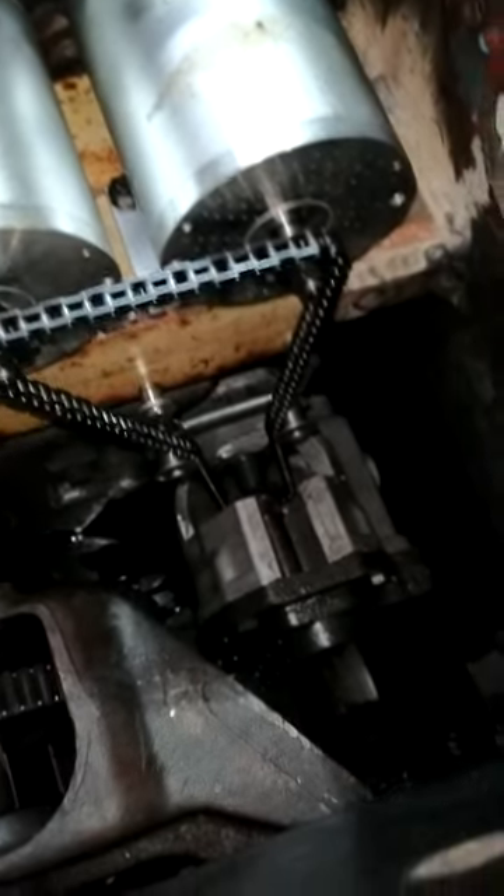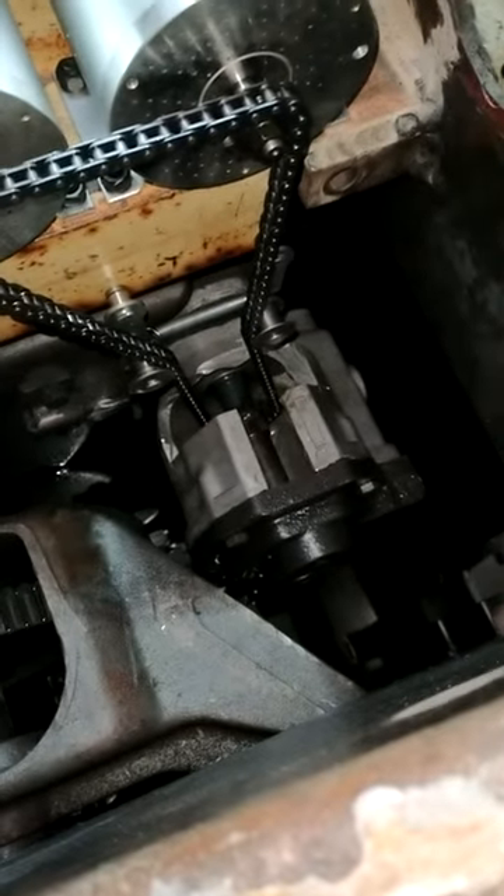Here's the next stage. All these chains are wired in, tensioners are on them, they're down to the hydraulic motors. I figured out my combined reduction from the motor to the wheel is 106 to 1. That should give us just over 3,000 foot-pounds of torque at each side.